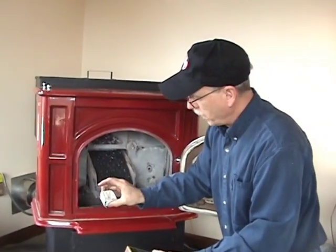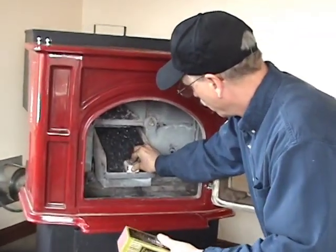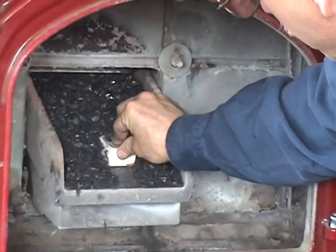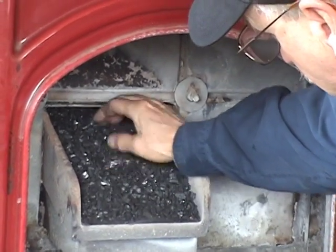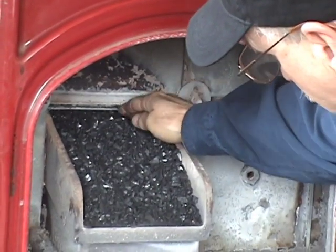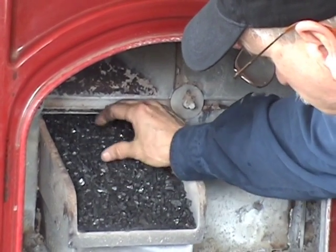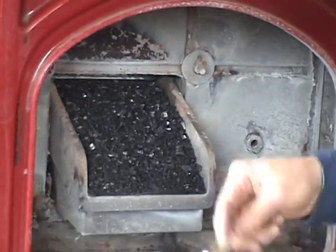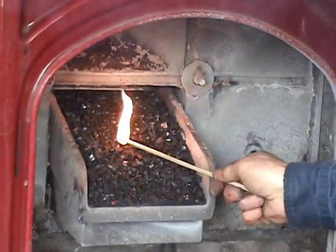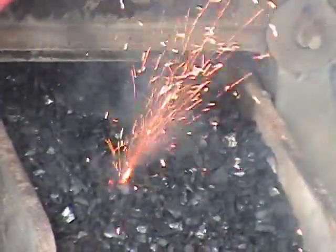This is your starter block. It burns at a very high temperature. Put it on the cast iron burner and shove it up to where the top air holes start, right in about this area here. Make sure you've got a half inch or more of coal on top of the burner. Then you light it and close the door quickly.